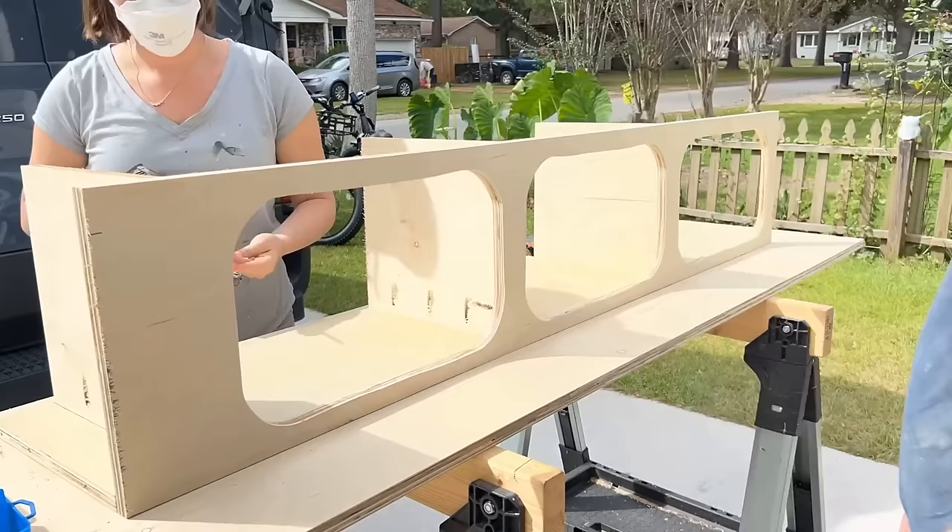The cabinets fit nice and snug. We ran the wires through the bottom corner, continued the slatted ceiling onto the back side, drilled three more holes for LED lights, popped them in, wired them up, and tested them. Then it was time to install the vinyl floor on the back — we laid out Loctite subfloor adhesive, spread an even layer, and rolled the pre-cut floor onto it. We let the floor dry for 24 hours before starting the electrical system.